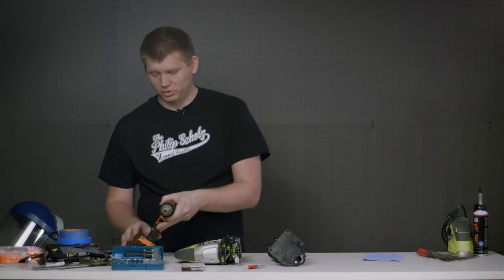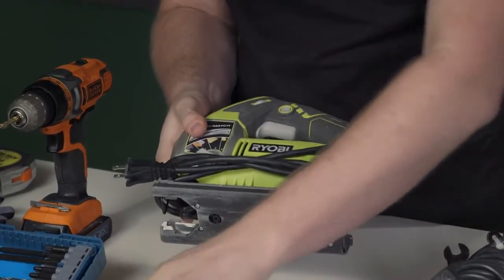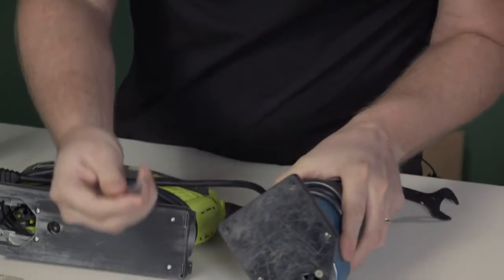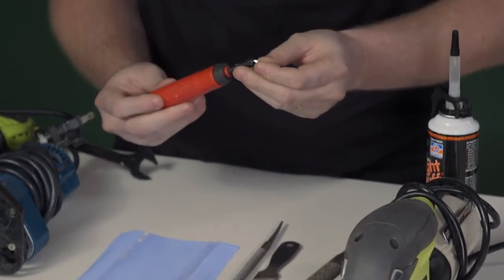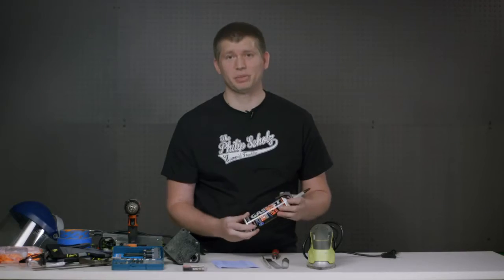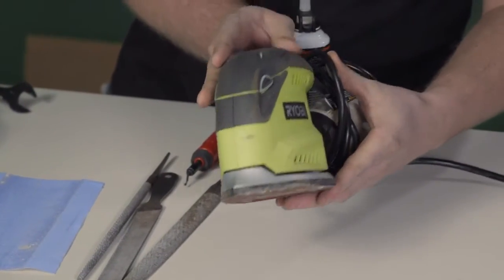Moving on to power tools, we have a cordless drill and drill bits, a jigsaw for the rough cut with metal cutting blades, and a router for doing the final cut with a ball bearing flush cut bit. For the finish of the panel, we have a deburr tool, a variety of files, sandpaper, gasket maker to mount the acrylic, and a sander for finish before we paint it.